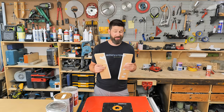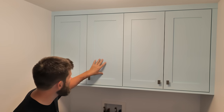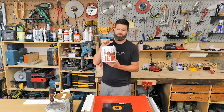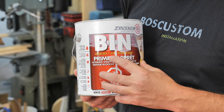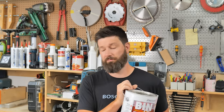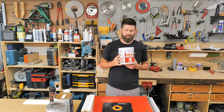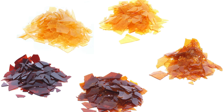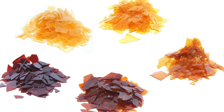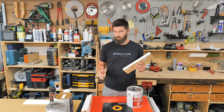If you're trying to get great results painting raw MDF, or you're working on a project made out of real wood like these cabinet doors back here — I made them out of maple and maple plywood — you're going to want to use a product made by Zinsser called BIN. More specifically, it is their shellac-based primer. The reason this primer works so well for raw wood is that it is not water-based; it's alcohol-based and contains shellac. Shellac is basically a resin made by the lac bug, and the beauty of it is it's not going to raise the grain of wood like a water-based primer.